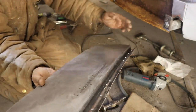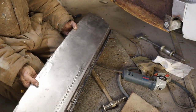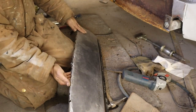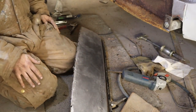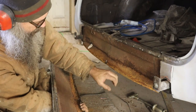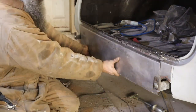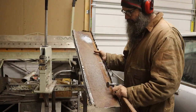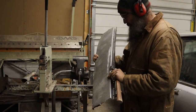There's enough to make a pattern from — probably go halfway through and just make the bottom here. There's not a ton of pre-work to do. We'll fold this edge and we'll shrink it, probably run a little stretch on the top half of our piece, and then weld it together. Once we've got that built, we'll clean this up and paint it. Luckily it's still solid, kind of crusty. I'll get started and rough out the piece — that's all we'll have time for this week.